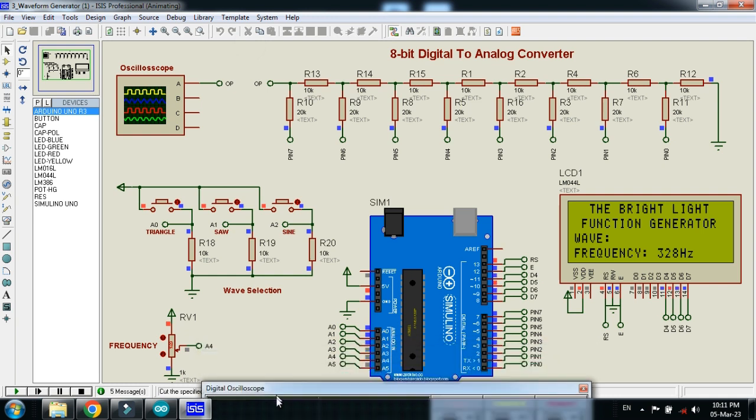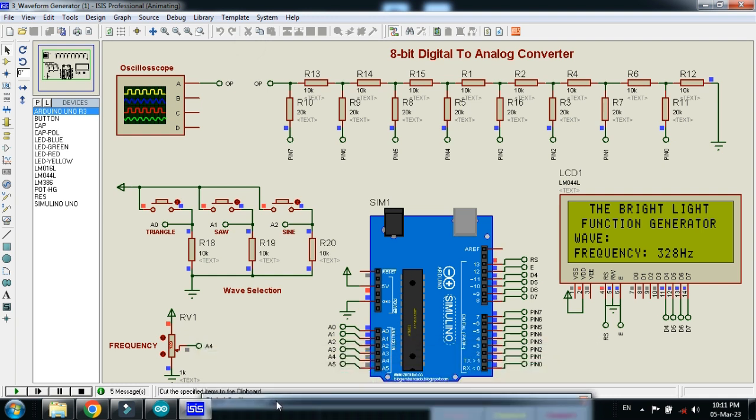Let me bring it down. Here you can see the bright light, my channel name, function generator, the project name. Here you will see the waveform. Whenever any button is pressed, it will say whether the sine, saw or triangle signal is selected. Here you can see the frequency as well, and it will be changed with the help of this potentiometer. If I increase it, the frequency will increase, and if I decrease it, you can see the frequency as well.